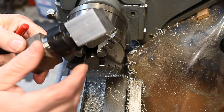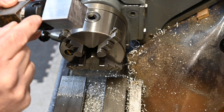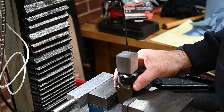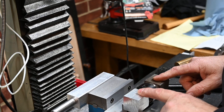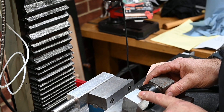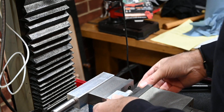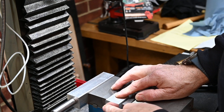What we've got to do is reduce this down to halfway across the centre of the bit we've just turned down. I think this is going to work better if I don't have it in a collar — if I keep this true to the fence, the back fence on the vice. Yeah, let's take it out of there. First thing I need to do is to square this end up.